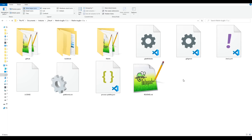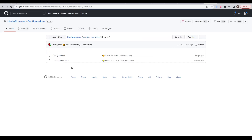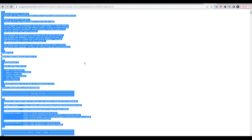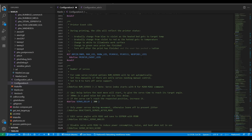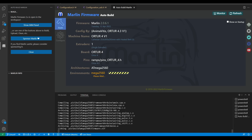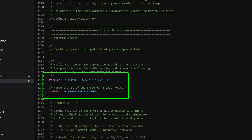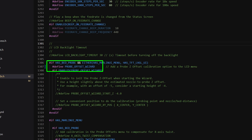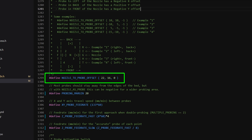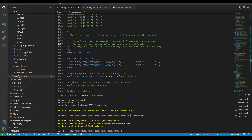This is an obscure 3D printer, but Marlin 2 is now the norm and there are example configurations for this printer on GitHub. I created a new branch, copied over the configuration, and had one compilation error — the fix was as simple as disabling the speaker. I also made quality-of-life changes: using the probe instead of a Z endstop, turning on the Z offset wizard, enabling baby stepping to easily tweak the offset while printing, and correcting the probe offset. The mainboard is 8-bit, so I plugged in a USB cable and flashed the firmware from VS Code.